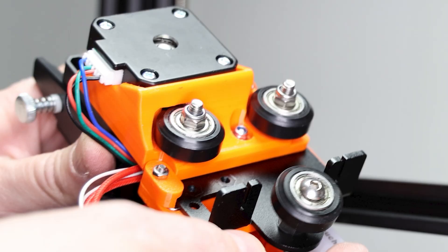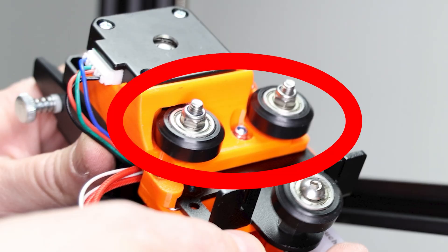Another big change: prior to Gen 6, direct drives were through add-on parts that clipped to the V rails or to the X carriage — like a Micro Swiss direct drive mod or a printer mod where the extruder bolted to the X carriage. The problem was that if you had an extruder on top, there could be flex, which caused problems during retractions. I experienced this on my own printers.